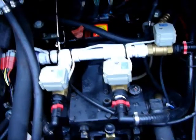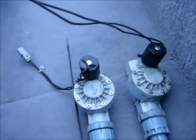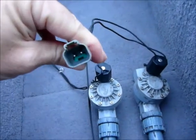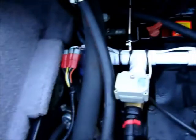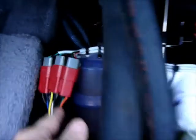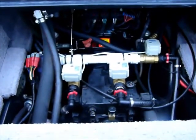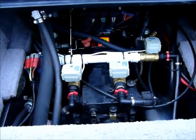The other component is that the original system had a two-wire on-off — the solenoid was either on or it was off. These mechanical ball valves have a three-wire scenario. So I had to build a bit of a circuit board to adapt that over so I can maintain my same switches in the boat. If you guys are interested in understanding what that circuit is, I can forward it to you — just give me an email.